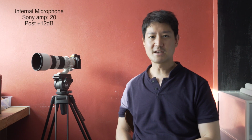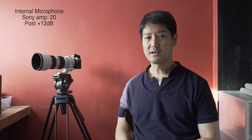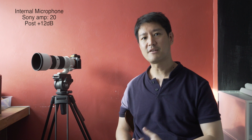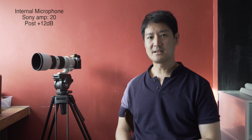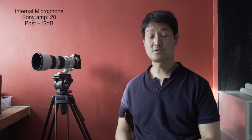Okay, we're still testing the internal microphone of the Sony a7s. The audio level now is set at 20. With me projecting a little bit, I'm about 1.5 meters away from the camera, and we are finding that the volume levels are about -10 dB. It's a car passing outside. Let's just listen to the noise floor.